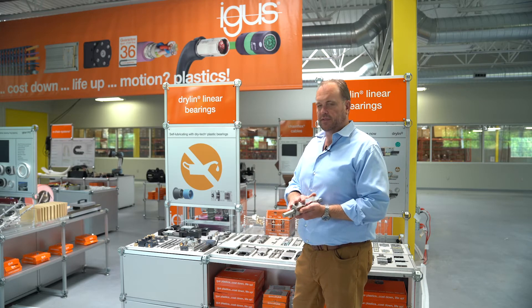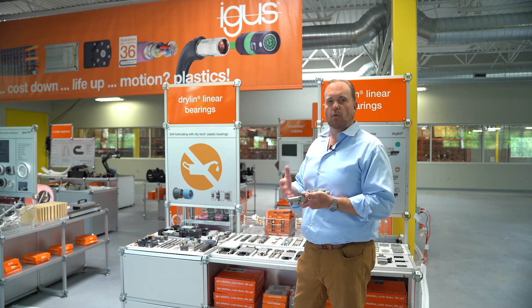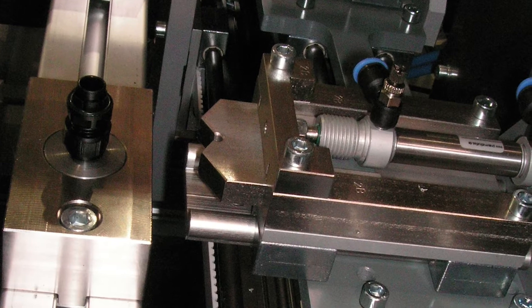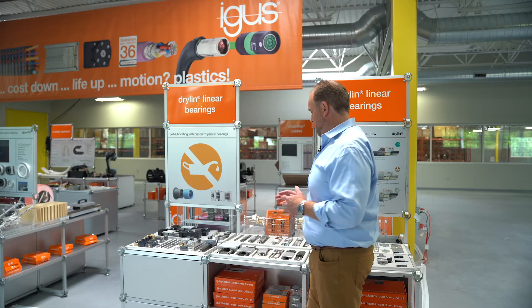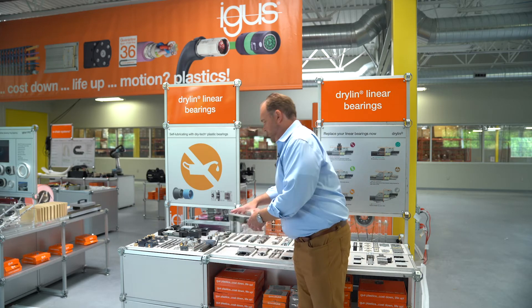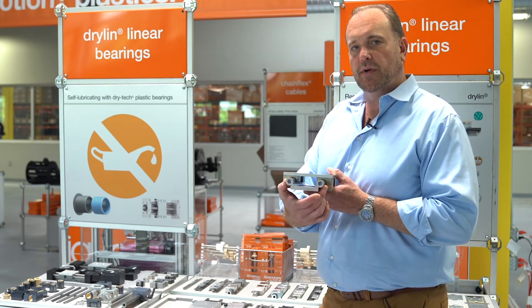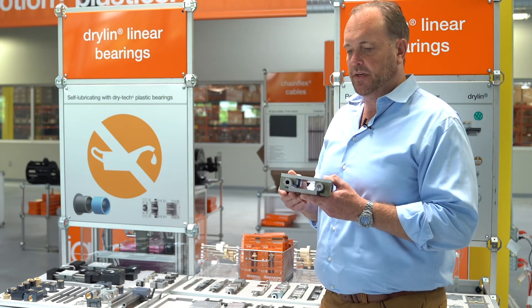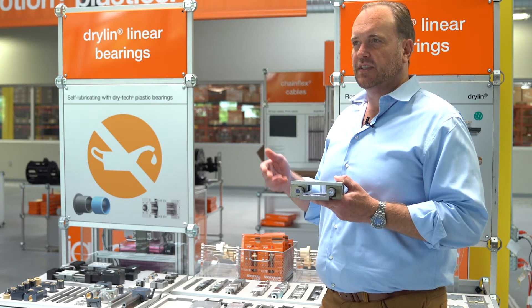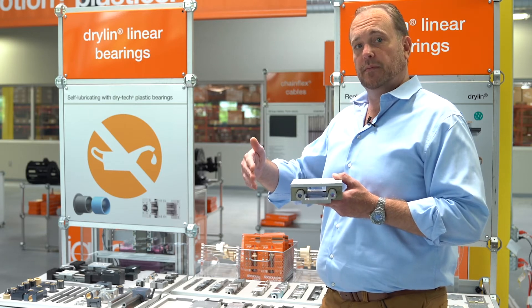We also offer these in low weight aluminum carriages as well as 316 stainless carriage options. The nice thing about this is that the 316 version — ball bearings can't run on 316 — which is the best series for salt water use or very highly chemically resistant requirements. We also offer this in our very popular double rail configuration. The double rail configuration eliminates the requirement to have two separate guide rails. We have one extrusion with two guide rails extruded onto a single piece, in several different diameters and several different widths from 6mm by 30mm to 25mm by 120mm wide.